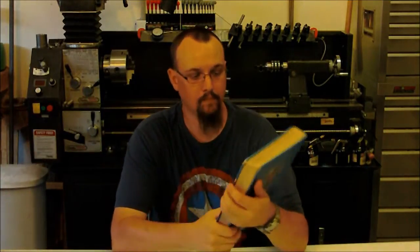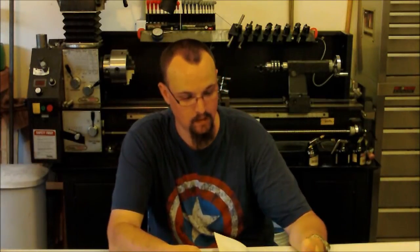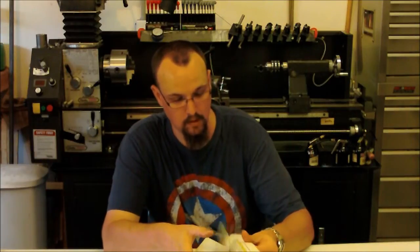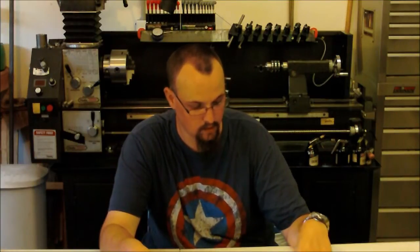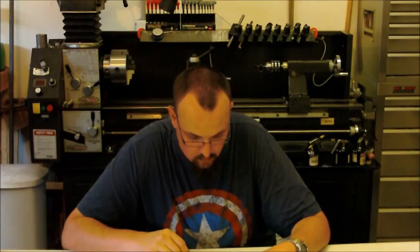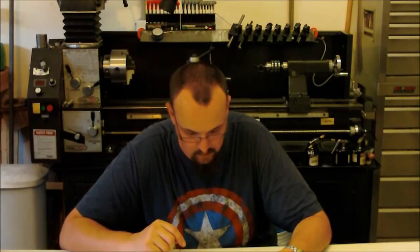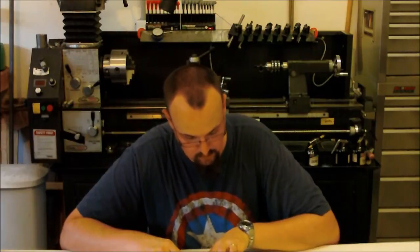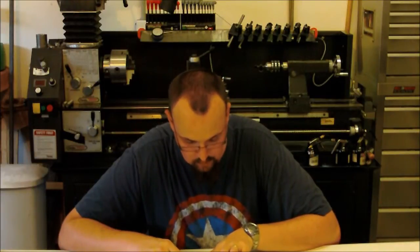So I got out my Technology of Machine Tools book, and inside it has all the information, the different charts in the back here, with tolerance fits and what the sizes are for each measurement. So force fits, the tolerances for a half inch to 1 inch. The barrel of the shotgun is 0.8585, according to the measurements that Jeff took from Taofledermaus, and the tolerance for a half to 1 inch part is 1 to 2 thousandths.